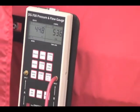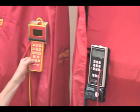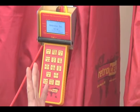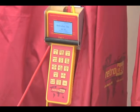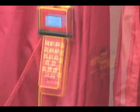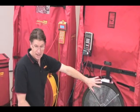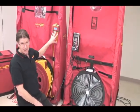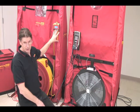There's another way this can be done with this style of gauge. It has what's called smart referencing — it knows what direction the flow is going on the fan and makes a mathematical subtraction of that pressure. Instead of subtracting it pneumatically as we're doing here, it subtracts it electronically inside the gauge itself. With this kind of gauge, you never have to worry about it. As long as you put the tubes in the right place, it always knows what to do and does the right thing.